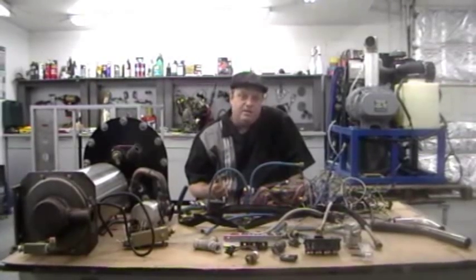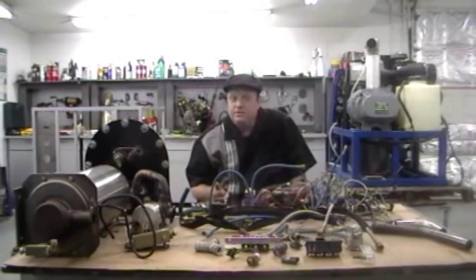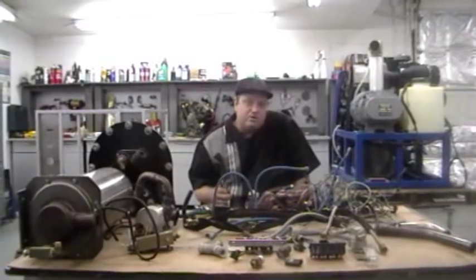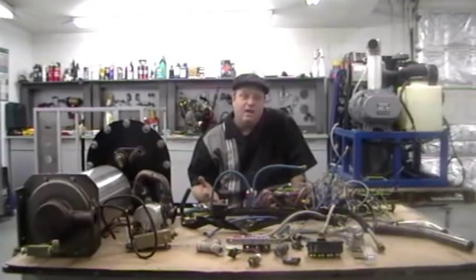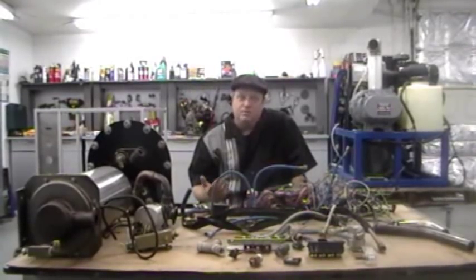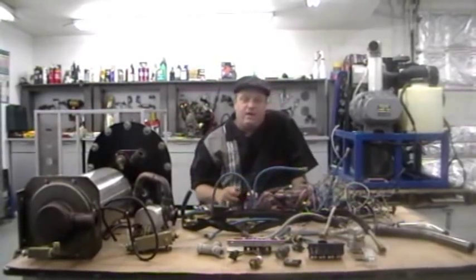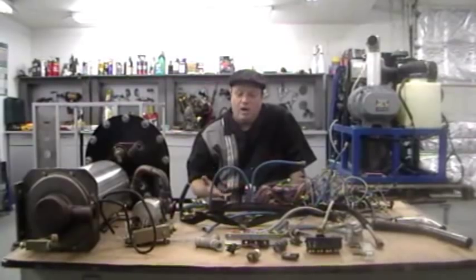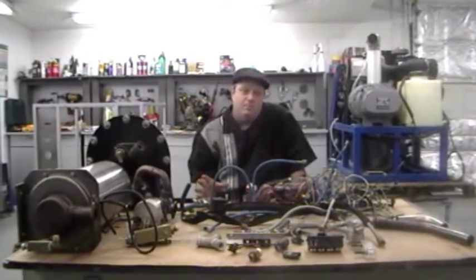We eliminate blower heat exchangers, which takes the back pressure off your blower and increases the CFM of your truck mount. We also take the back pressure off your engine, which makes the engine more efficient. That's how we extend the life, performance, and reliability. We convert to common parts that you can find at a local auto parts store — switches, wires, anything we can find to make the machine more reliable and more common.